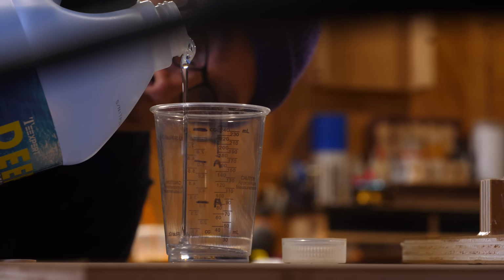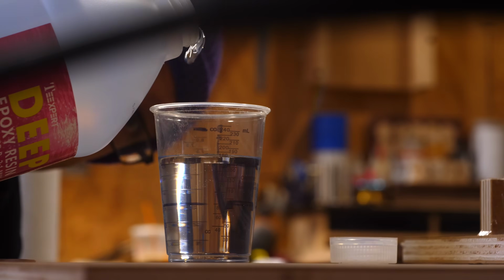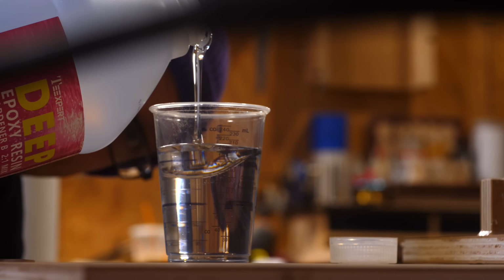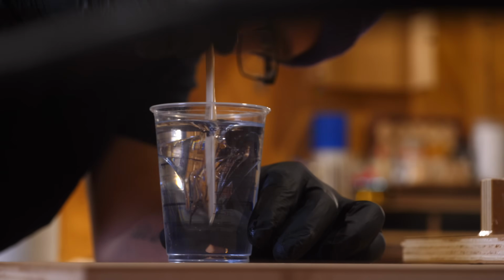And this right here is where the fun begins. Bennett starts mixing the resin. It's a two-part system. The first two-thirds of the cup is the resin, and the final third is the hardener. Once they're combined, a chemical reaction begins. You've got maybe 20 to 40 minutes of working time before it starts to thicken. So once it's mixed, you get right to pouring.